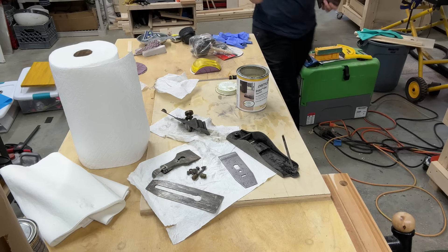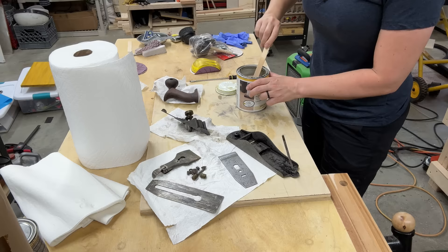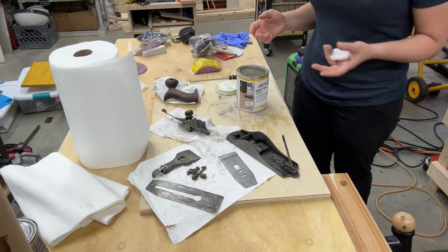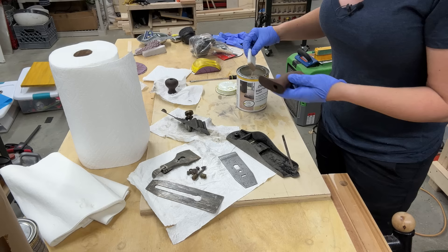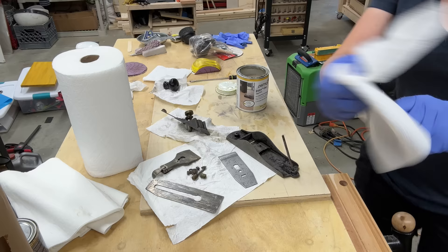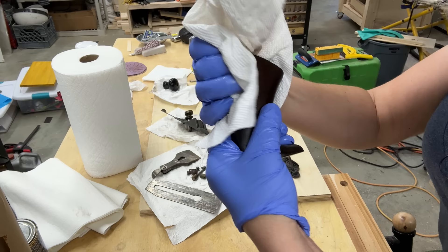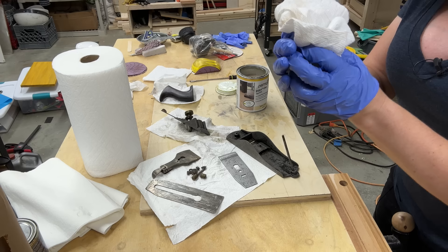I completely forgot — we have the handles to finish, so I'm going to apply a quick finish onto those handles so they can dry while we work on the rest of the plane. I'll be using Osmo. I like it because it's oil-based with a low sheen, and if I want more sheen I can always wax it afterwards. It's a really easy finish to apply — you just wipe it on and wipe it off; you cannot mess it up. I take most of the oil off while wearing gloves, then take my gloves off because I want to make sure I wipe off everything. It looks very, very nice.